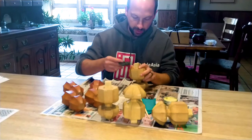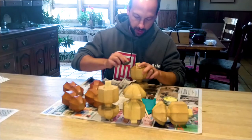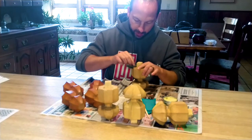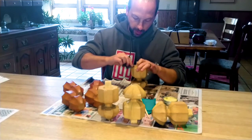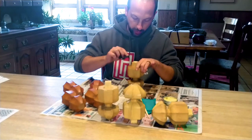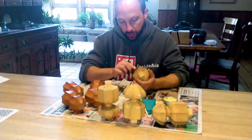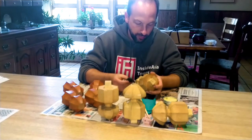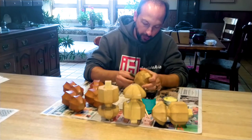I don't know why I'm bothering with the top. Why am I bothering with this surface that isn't gonna see the light of day? Because I want to protect it. The whole point of this wax is to give you a layer. The turpentine clears it off, and the linseed oil is processed. One of the differences between raw linseed and processed linseed is that processed linseed doesn't give the mold anything to eat. It doesn't provide food for any mold. Linseed is flax oil. Any vegetable oil is going to be a potential food source.